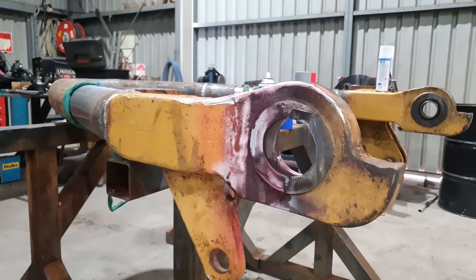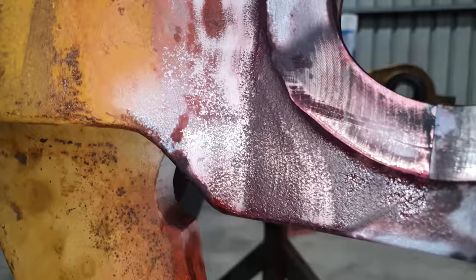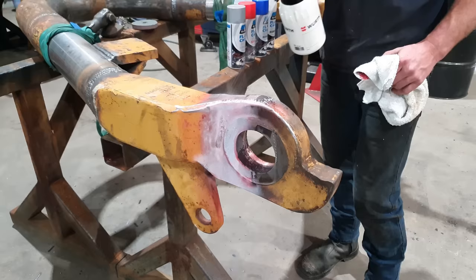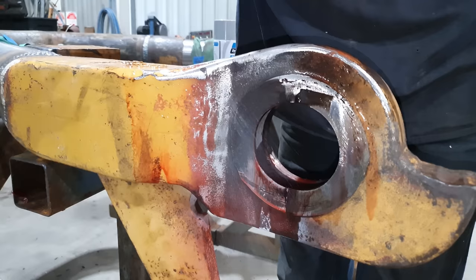Right, so as I thought, there are no cracks. People often ask, what does a crack look like once you use the dye penetrant? Generally, it'll be a white background and you will see the red penetrant coming through the white background. If there is a very fine crack in there, you will actually see little dots of red coming through it. So if there's a crack there, you're going to be able to expose it, providing you've cleaned everything and done the four-step procedure correctly. That's really good. I'm happy with that. Now we can set up the line borer.